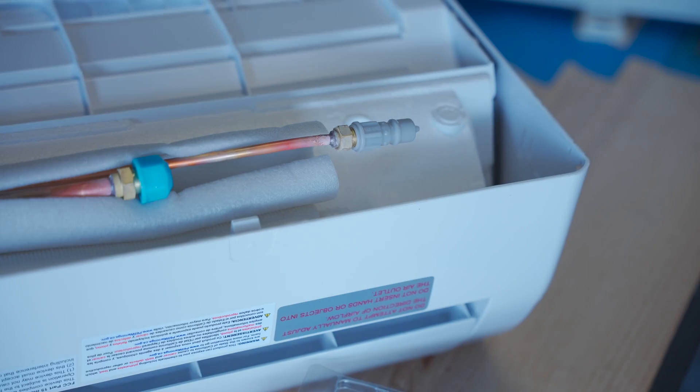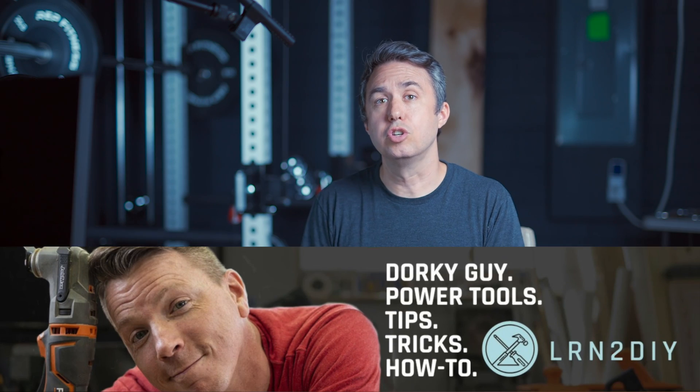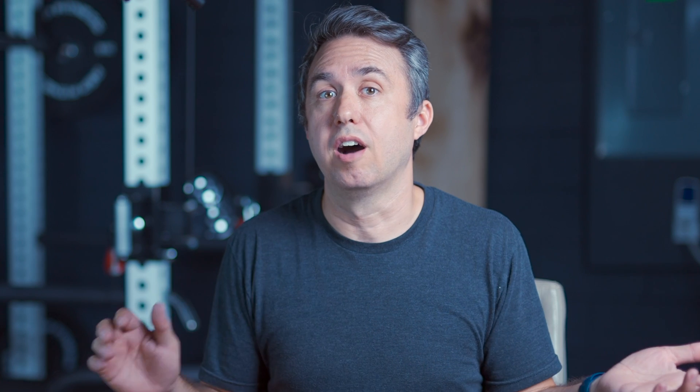Still on the indoor unit, I flipped it over on its back to expose the high pressure and low pressure lines. This is where you'll screw on the big padded hoses that go outside to the outside unit — these hoses are basically what needs to pass through the wall. If your place is wood framing it's a lot easier than if it's concrete block. When you take the cap off the high pressure hose, it's going to shoot out a bunch of gas. Don't freak out — well, you'll probably freak out, it's very startling, but this is by design. There are knockouts in the plastic housing where you'll pass your hose through. Pick a side and cut those out — I think I used a knife.